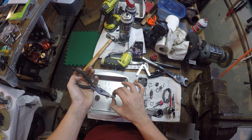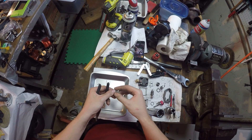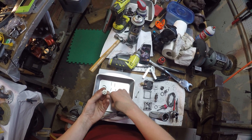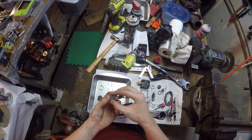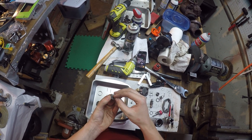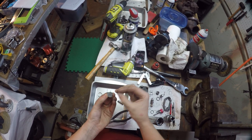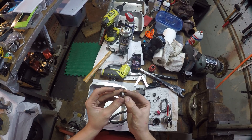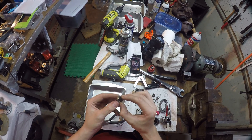Put your check ball in your check plate, then align your other plate onto there. Put your pins in like this — you want your pins sticking out a little bit on the opposing side.